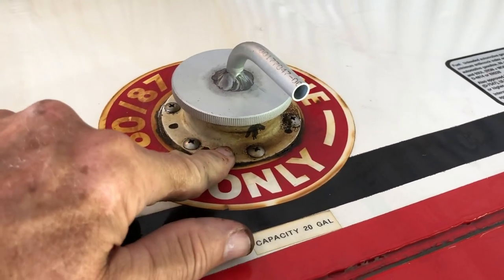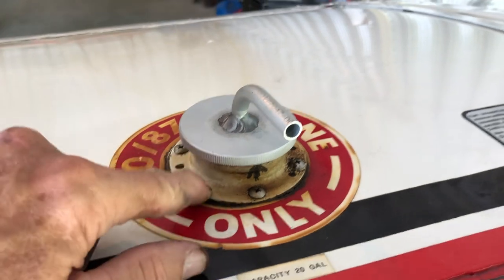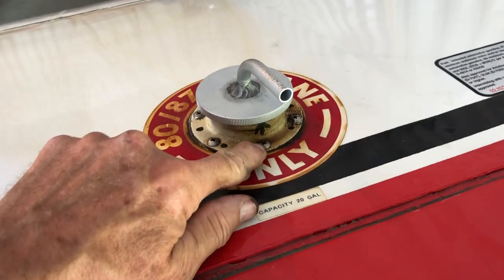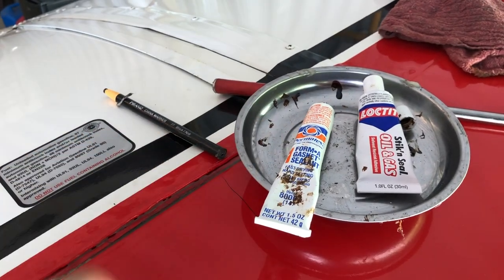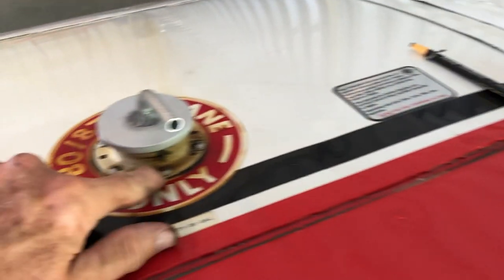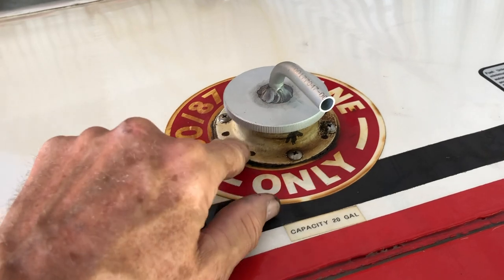I do not have to rotate this fuel nozzle. I put a tick mark here to indicate the front, so I'm just going to remove it and reseal it. I forgot to mention — underneath the head of the screw — I am using, on both sides, this gasket material underneath the head of the screw. I think that is an often overlooked area.